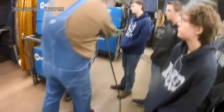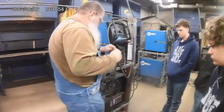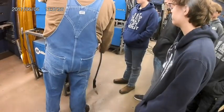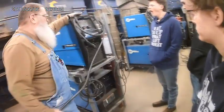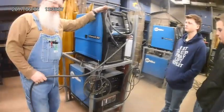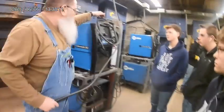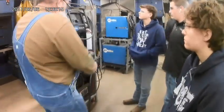What I don't want to have is anything laying on the floor. And I don't want this to come down below that little bar right there. If you come up tighter, I don't want it to come below. But I also don't want it to come in tight like this, where someone pulls it that tight. And the reason for that is someone could decide they're going to take the weld lead off and just tug on it like this. That's going to put a sharp kink or a bend in it right there and bend that liner. So we want this kind of loose up here.